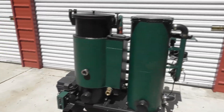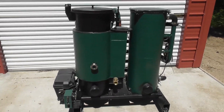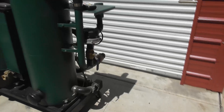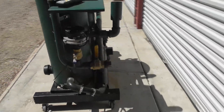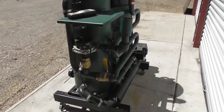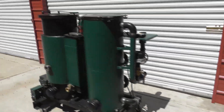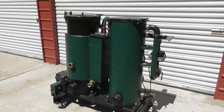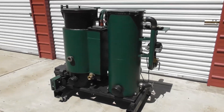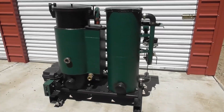The next major change is that it's now modular — no longer one big solid welded assembly. It's broken down into separate components: the base, the reactor, the filter, the cooling assembly, and the condensate tube in the back. It's all modular and can be disassembled. This is beneficial because it's easier to build — you can build each sub-assembly separately, test it separately, and do leak testing on each. It also allows for different configurations: maybe you want hot filtering, a cyclone filter, or more cooling tubes. You have a lot more flexibility with this platform than with the original design.